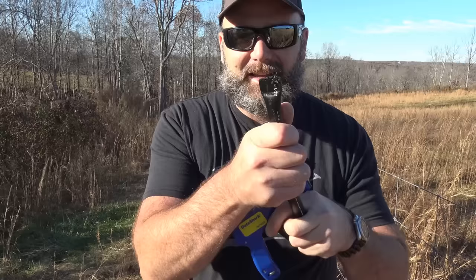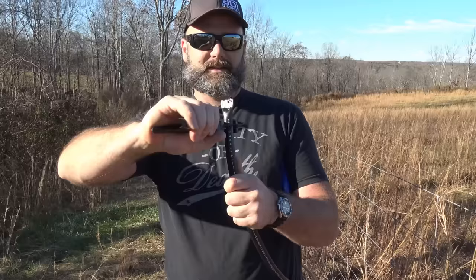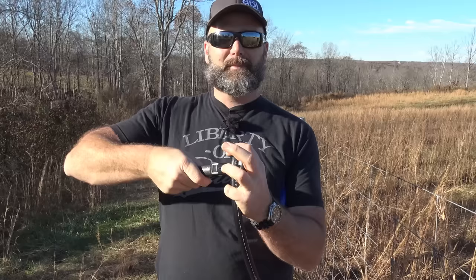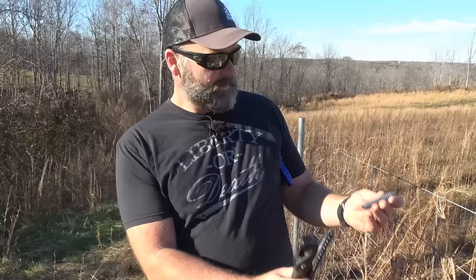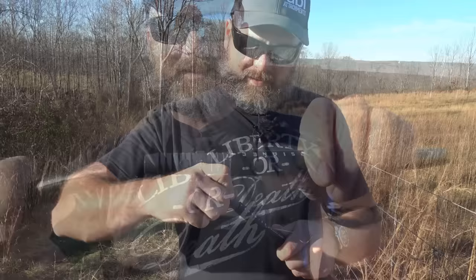This poly pipe comes with crimped ends, so I've got to cut that end off with a simple poly pipe cutter. We're using a coupling in my back pocket. Instead of hose clamps, we're going to use zip ties. We'll press these barbed fittings together on this half-inch pipe — cold weather makes it difficult and takes some strength. You don't want to kink the hose. Even though this is a low-pressure system, at some point we may end up burying it and it could become a high-pressure system.